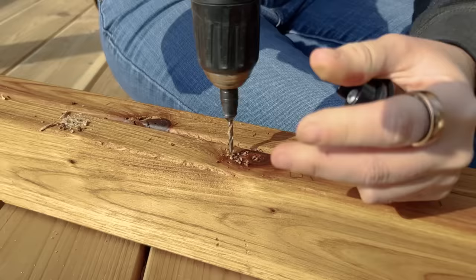On this diagonal railing there are two different ways you can do it. One, you can absolutely leave it square and just butt it up because the railing will come in and overhang it. However, a different option is that you can do a plumb line and cut it to where it's going to be vertical — and that's what I'm going to do. I'll use a torpedo level here to get a plumb line and then cut it.